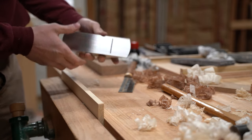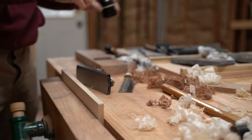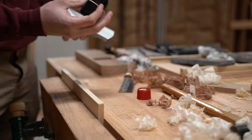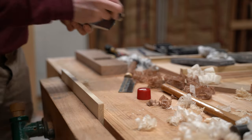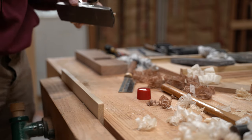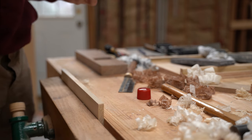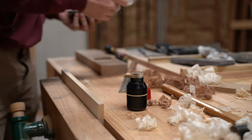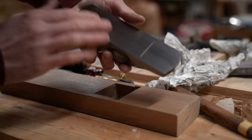Having a flat sole won't fix all your problems, but it might be the cause of some of them — which was definitely the case for me with all my planes. The plane looks really nice too, like brand new. I'd also recommend now that you've got fresh metal on there with no oil, applying some camellia oil using a Japanese applicator — just go over all the surfaces that might rust.